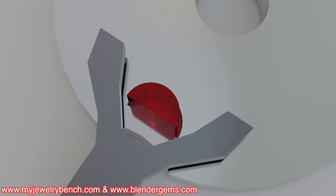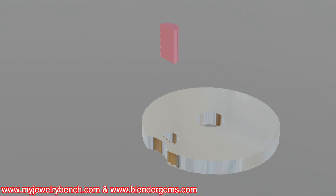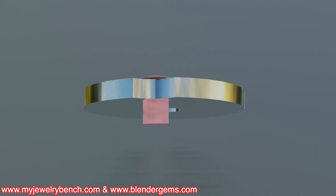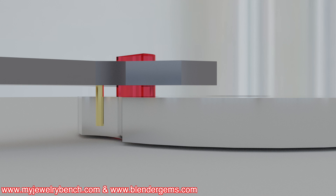If you don't know the exact size of your roller jewel, it's important that you match it to fit nicely within the confines of the pallet fork — it should not touch either side, it should be loose enough to just rock back and forth. You can put the jewel in first and then add shellac, or you can melt shellac onto the roller table first and then insert your jewel from the opposite side; for beginners that'll probably work a little easier. When you're done, you should have a roller table with the protruding jewel from one side and melted shellac on the opposite side holding it in place. There should be a little gap between the roller table and the pallet fork to allow for free movement.